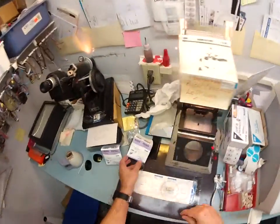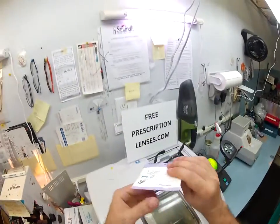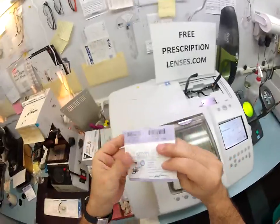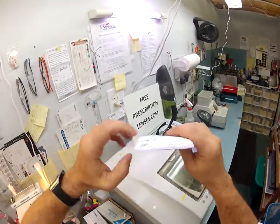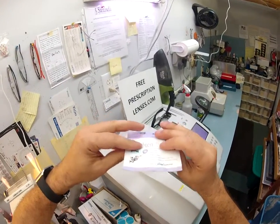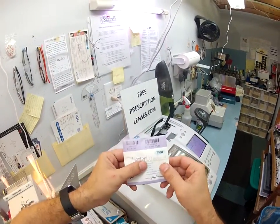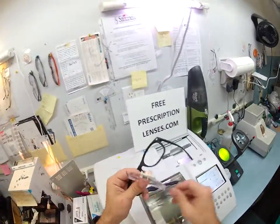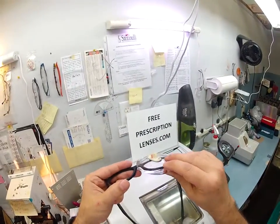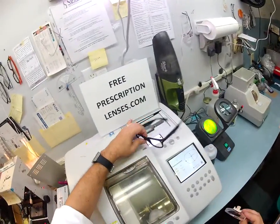Your lenses are an aspheric lens, meaning that a spherical lens is completely round, unlike your eye, which has two curves on it — round like a basketball. Your eye is more like a football where it has a curvature going one way, and that's where the astigmatism is, and a second curve going the other way. An aspheric lens is much flatter. It does not give you that fishbowl effect. Your lens is not going to be this thick, but it's a much flatter curvature — it doesn't give you that fishbowl effect that cheap lenses will give you.